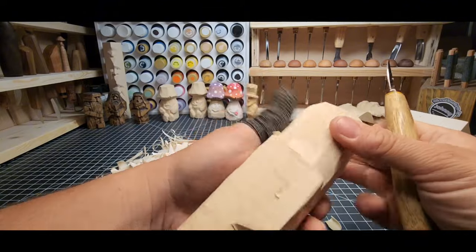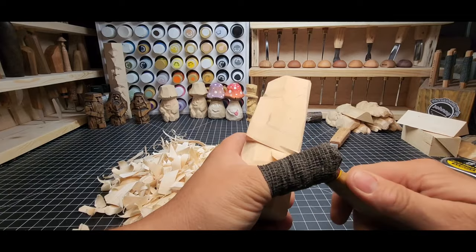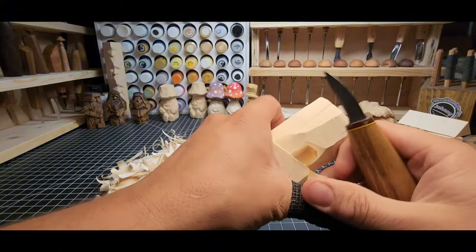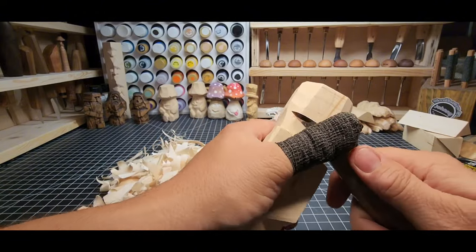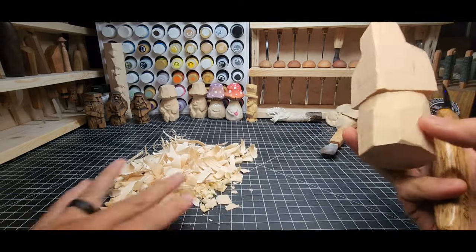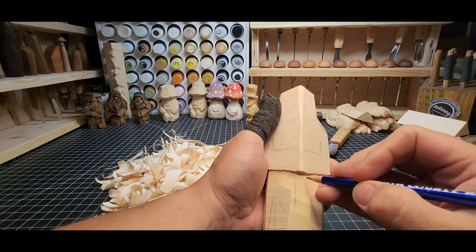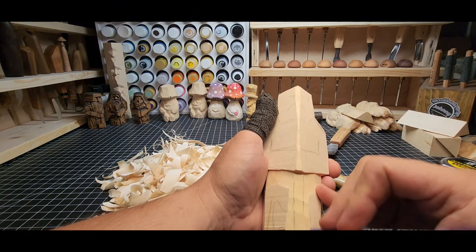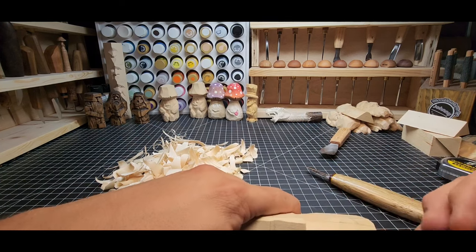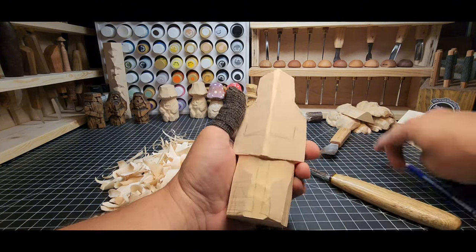Just be careful not to take too much — leave plenty so you have room to work. Then we can start taking back up to the arms, just underneath there going up to it, stop cut the arms to pull those chips out, add a little depth and definition to the bottom of the arms. Being careful not to take out too much from the shaft, we're going to go and redraw that shaft so you can be mindful of it — keep track of it, know where it's at, because you don't want to get it any deeper than it is right now.